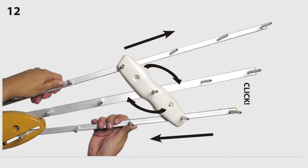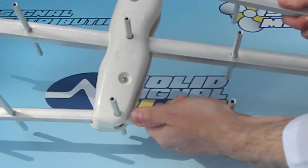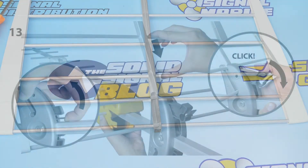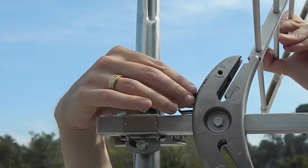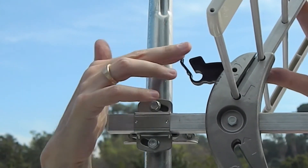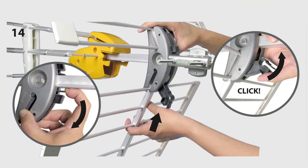In the next step, you're clicking the piece into position so that the three directors have the proper spacing. This is not so hard — just push on one side and pull on the other. Next, you'll be putting on the reflectors. Notice that two of them are closer together — those are the ones closest to the mast. Slide them in; they fit inside notches. Pull up the plastic part to get everything in there, then push the plastic down until it clicks into place. Repeat this step with the bottom reflector as well.